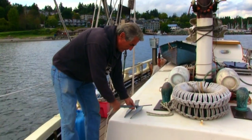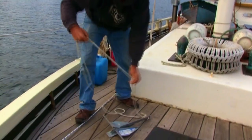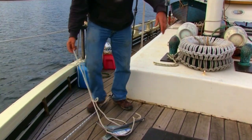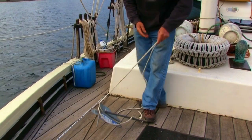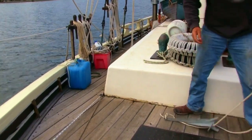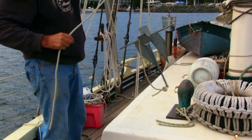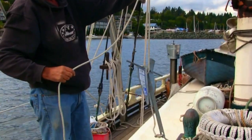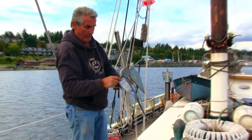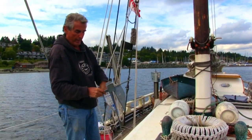When you have no current and no wind, and you are hovering over it, the rope gets wrapped around it. If your boat just keeps on going, it trips itself and totally loses its holding power. Then it goes like this, and you just drag it. And then when you lift it up, that's how it comes up. It happened to us on 2 or 3 occasions. Because of this, it is very undependable except for a straight pull or as a stern anchor.